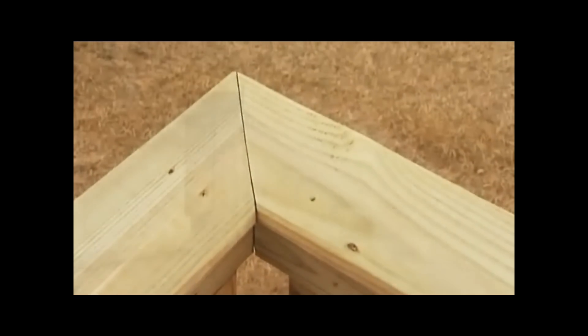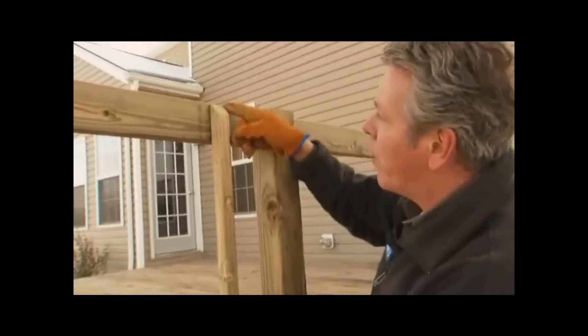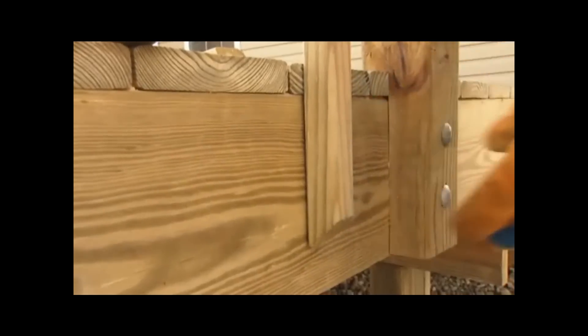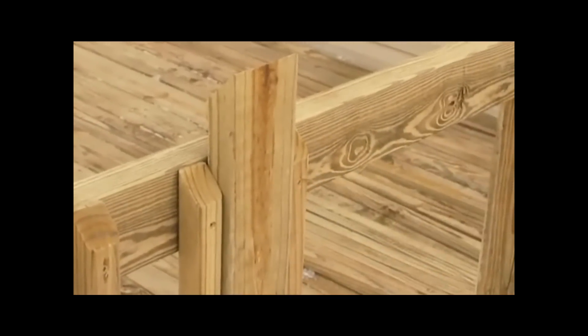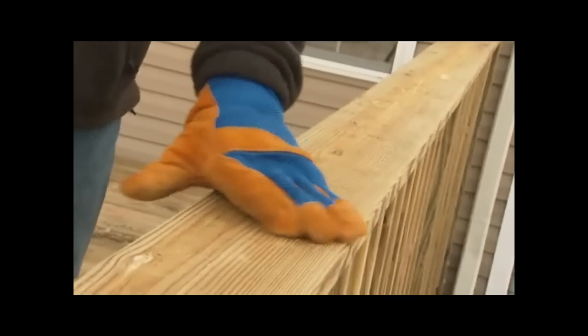With all the posts in place, install the two-by-fours at the top and attach them with screws. Use a miter saw to cut corner joints and joints on the stair rail, then attach the balusters. You can buy them pre-cut or cut them yourself — they need to be flush with the two-by-four rail and extend to about the middle of the joist. Space the balusters evenly at the top and bottom, keep them plumb, and use a spacer to ensure equal distance between them. Attach the top rail with screws — five-quarter decking makes a great top rail because it has a smoother surface than regular lumber.